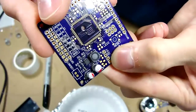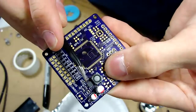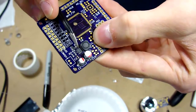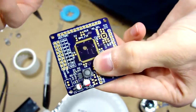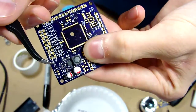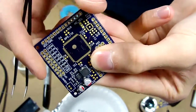Okay, I've got the switch mode power supply soldered together here. Right here is the TPS61-200. This is the main inductor for it. These two electrolytics are filtering caps. C2 right here is a little filtering cap, and then R1-4 are voltage dividers for various settings on the chip.